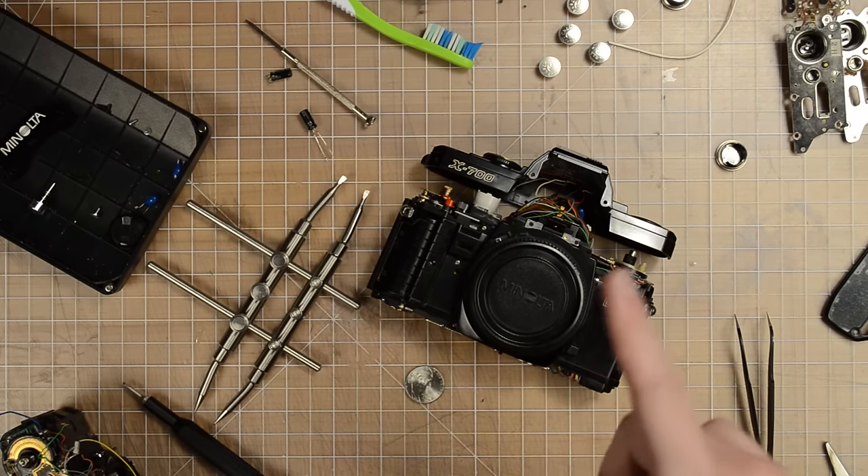I also took the opportunity to tune the shutter speeds using the brass eccentric screw at the front left of the camera. Here are the results from before and after the CLA. I was able to get all the speeds within tolerance, except for 1/125, which I was able to get within 0.00038 of tolerance. After all that messing around, you'd probably think I would just cut my losses and turn this into a Minolta X700 CLA video, but no — I will press onward. But first, we need to get a few things prepped and ready to go.